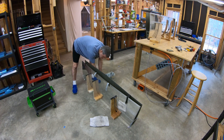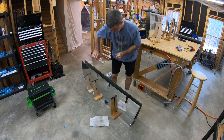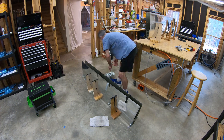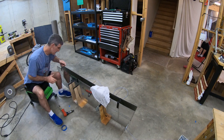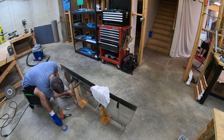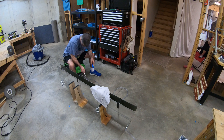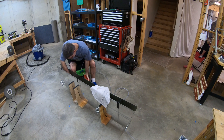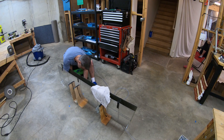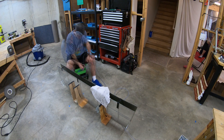The reason for that is when you've got just the nose ribs and you're trying to get those cleco'd in place, the skins are really trying to spread back out with a good bit of force. Just the nose ribs alone are not really enough to hold them on their own without the cradles holding the skins tightly in — it'll just bend those flanges on the nose ribs. Even with the cradles there were times when I had to stuff a rag in there to help push things in and keep it flush for riveting.